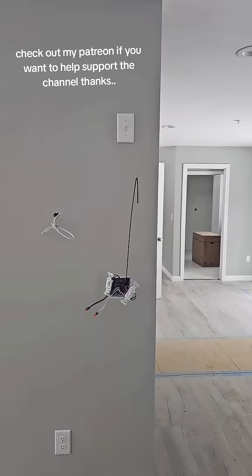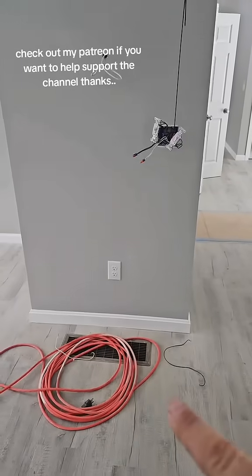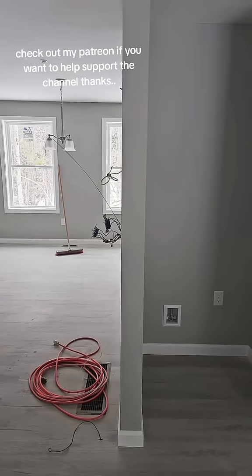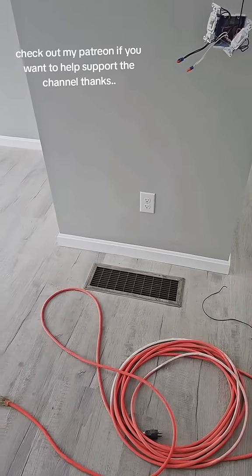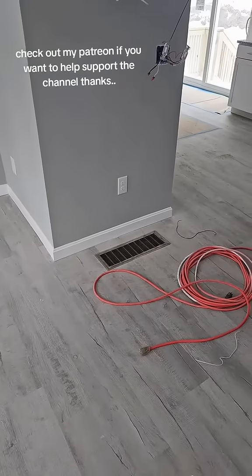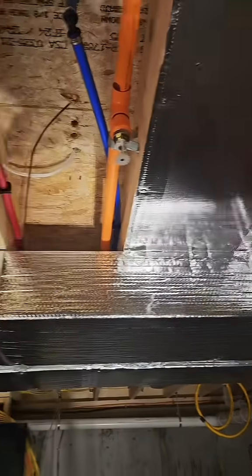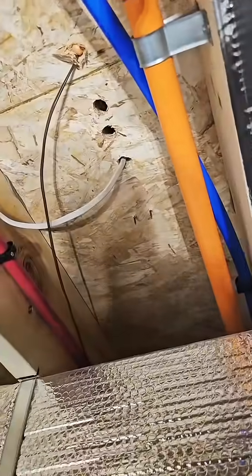With the snake in, there are a couple things we want to notice before we go to the basement. There's the furnace switch, a thermostat, and ductwork, and it's an interior uninsulated wall — all that factors into the decision of which method you use. The big grates like that are the return; the little ones are supplies. A return looks different in the basement than a supply. So I drilled two holes between the two.